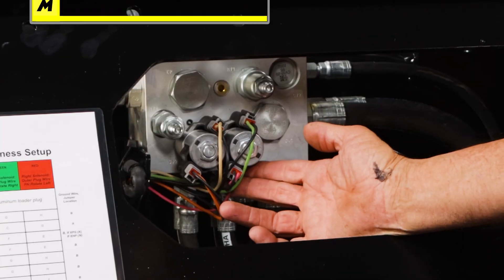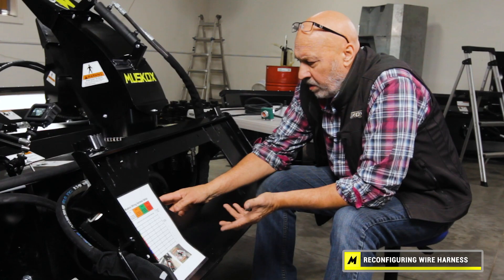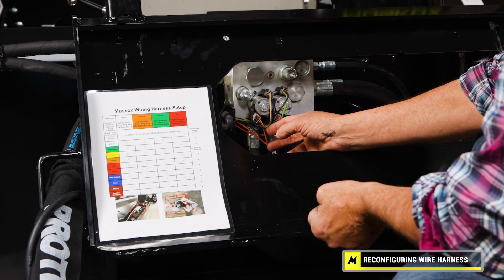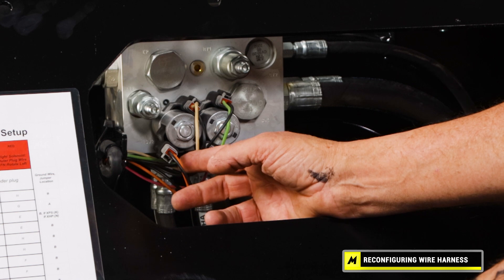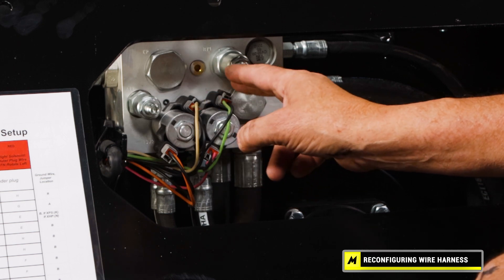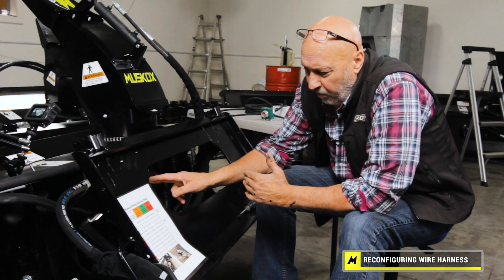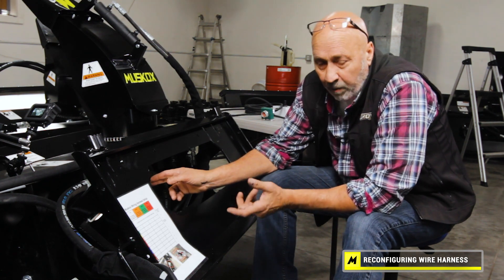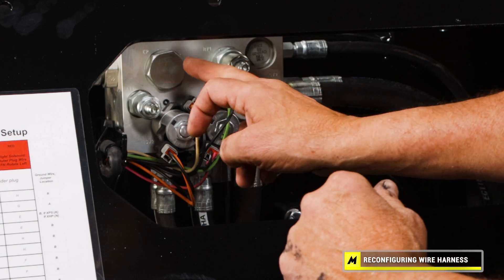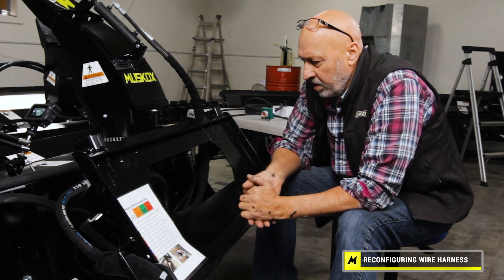These electronic coil packs are just 12-volt coils. Each one has a ground wire, so in our harness you'll see there are only five pins coming out of the 14-pin or 8-pin outlet — the ground wires are all connected together and come out of one pin, and then each color has an individual pin. The location on the block is something we've learned — which button on the skid loader we prefer for each function. That said, you can interchange them without causing any damage; it just comes down to ergonomics and which buttons you prefer to push.